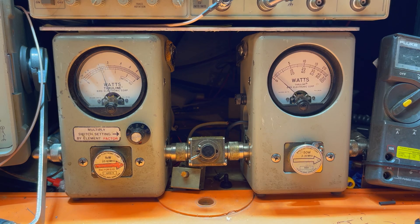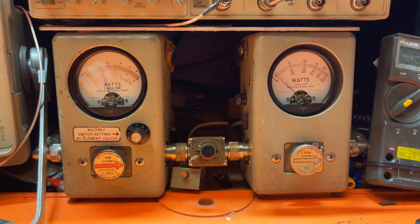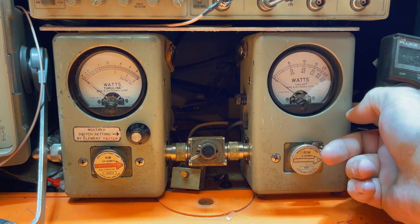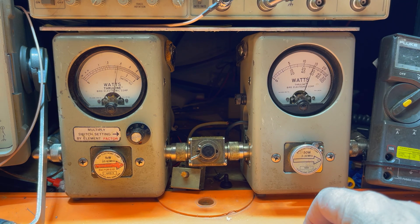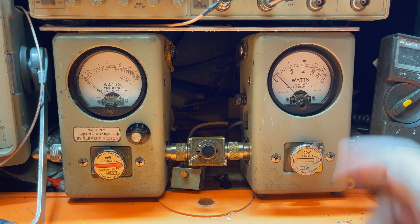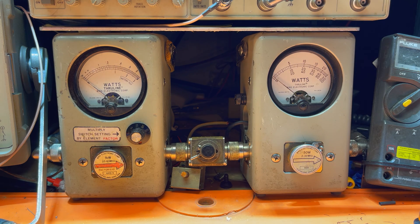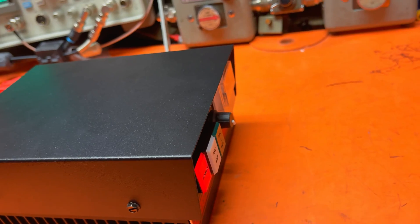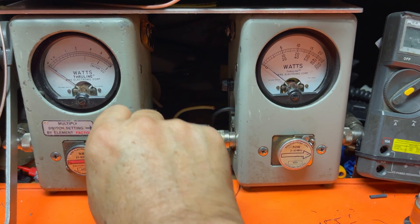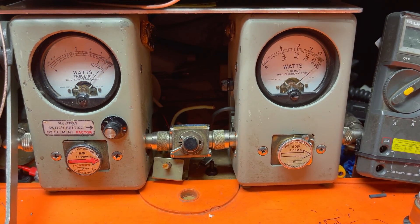So this is how I have my driver set up. We're dead-keying about 1.2 watts, 1.1 watts. Over here for peak power — 20 watts constant peak and around 25 there with the constants, so no more than 25 watts of swing. We turn that on and on the 100-watt scale, keyed down, we're getting 72 to 73 watts.